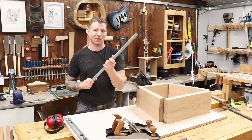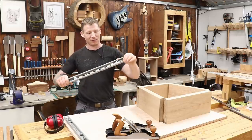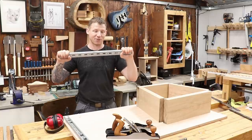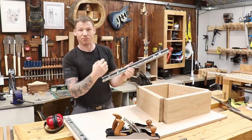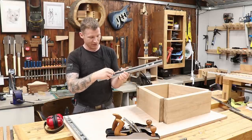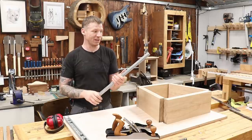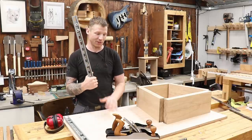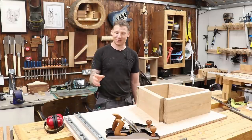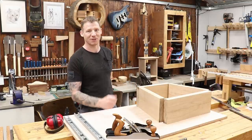Instead of routing into the table, I'm going to fix the unistrut to the base of it and then route the unistrut into my legs. The unistrut has side walls just like C-channel, so it's extremely rigid, strong, and resistant to bending — that should help keep the table nice and flat. The beauty of unistrut is you can fix things to it using spring nuts, which you can position anywhere along it, in sizes from 6 mil up to 12 mil. That's how I'll attach my legs.